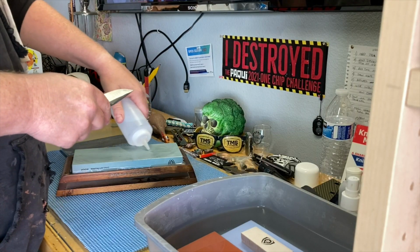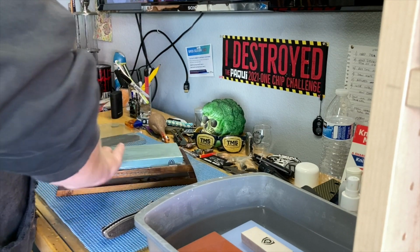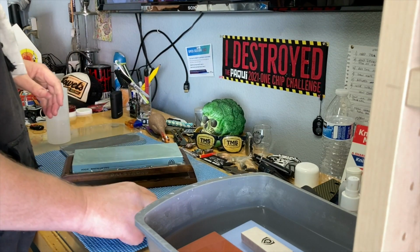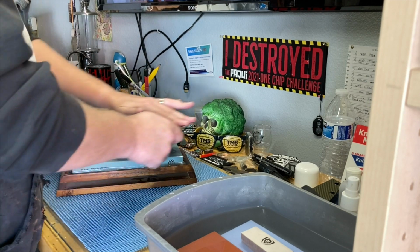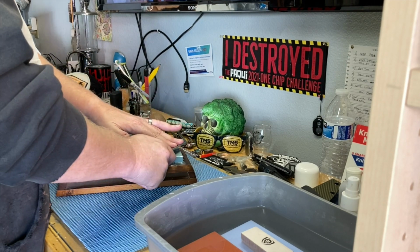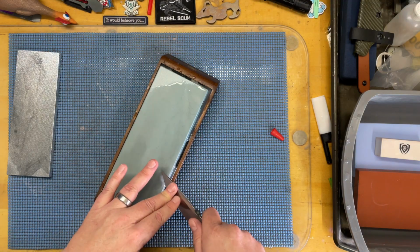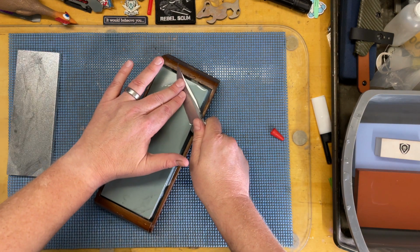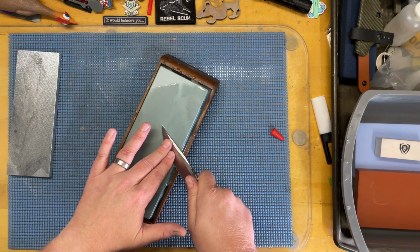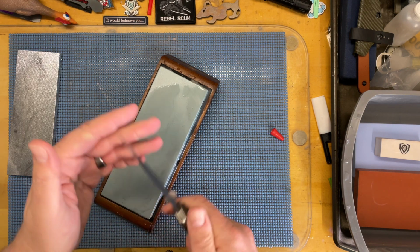So I'm gonna wet the stone again real quick, and I'm gonna do some simple deburring passes, which are super, super light passes, no pressure. You can do them in a stropping stroke, or you can do them this way. On my final strops, I will be doing the final stropping strokes, but all you're doing is just going one very, very light pass just to remove any burr that may have formed